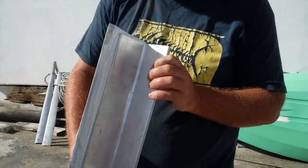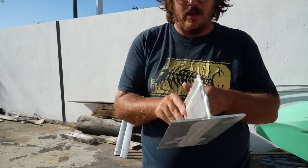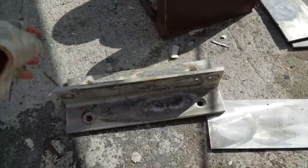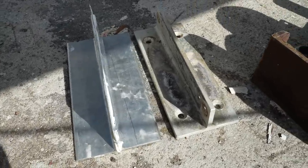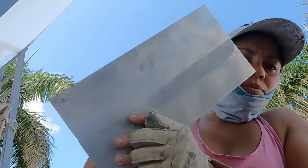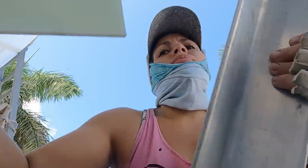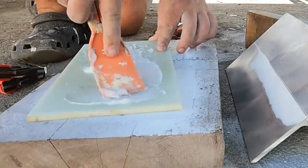They brought us two L-sections of aluminium that we glue together, epoxy together, and bolt together to make a T-section, to replace the old T-bar that had a crack in it. This was the best we could do for fitting the exact dimensions we needed, without having to weld the cracked aluminium T-bar. It's always better to create something stronger than what broke in the first place. And now we were going to complete the mast step by adding some G10 to the bottom of it. I did some cleaning, epoxying, and fairing before Robbie drilled the holes to bolt it onto the deck.